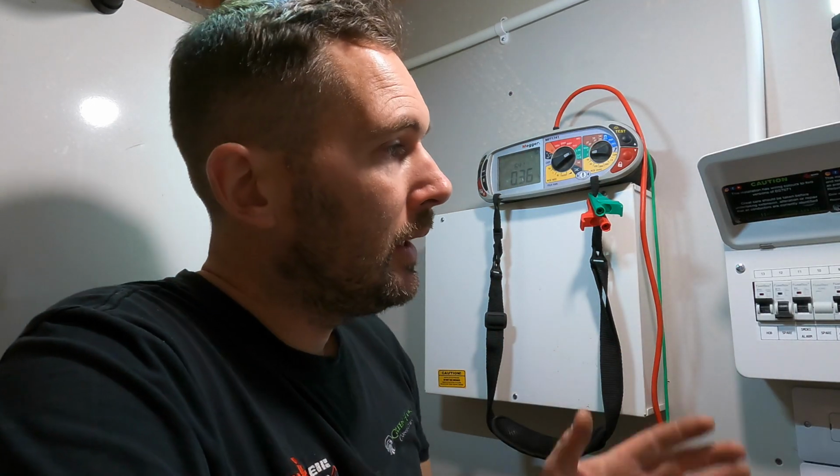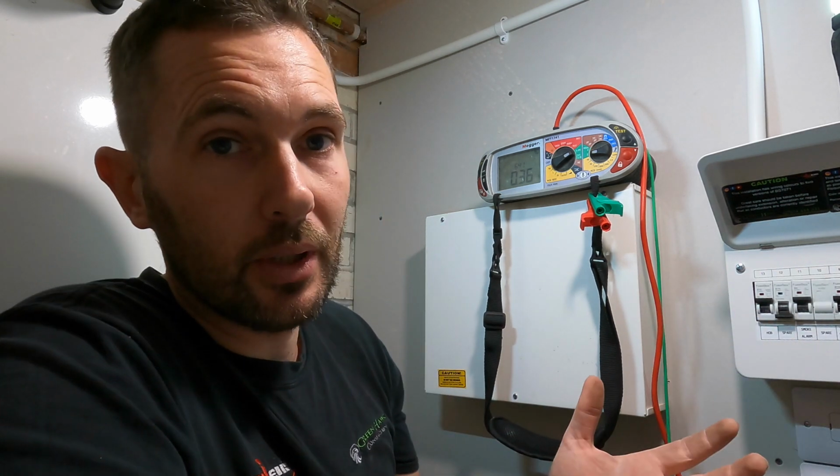So what more tests we need to do? RCD testing. Okay, so we've got RCD at the other board. So what we're going to do, because I know on this board I've got sockets. So again, you can test at source. So when we're doing a full board change and it's all RCBOs all the way down, we always just test at the board and just test purely the RCD. So we've not got that situation.